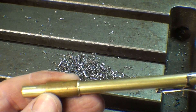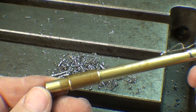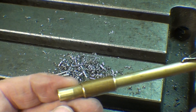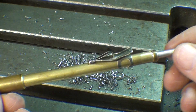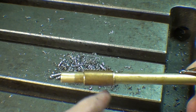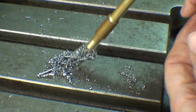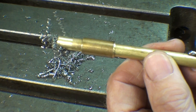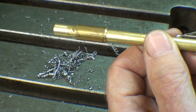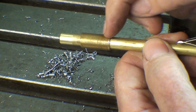Now, what's this enlarged section for? Well, you cannot insulate from magnetism. The only thing you can do is create some distance. The chips would follow the magnet up the tool as I retracted it, so it's thicker right here and the magnetism has less of a chance to travel through that thickness because it's just a greater distance. Most of them are getting knocked off, but when I do it too slowly, they don't. So it could use just a little more thickness here.